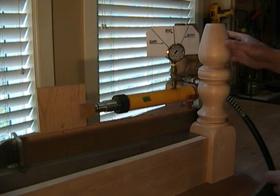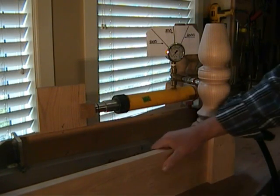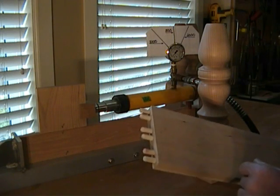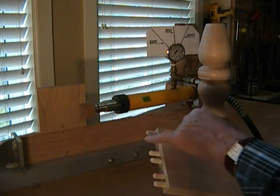The design of this coffee table incorporates a 1x6 to a 4x4 joint. For that joint we could incorporate 8 dowels, however that is dramatically overkill, so we're going to use 6 dowels with a space between here and here.